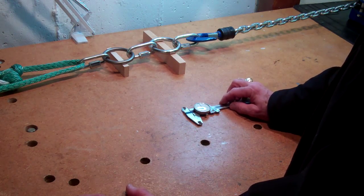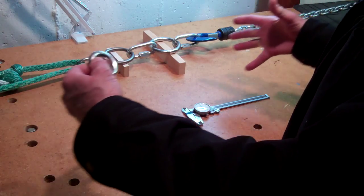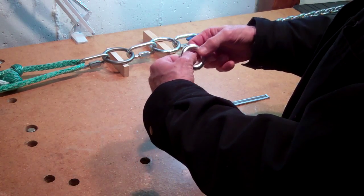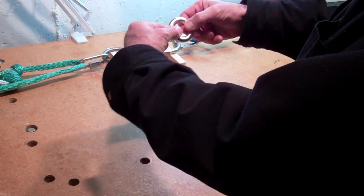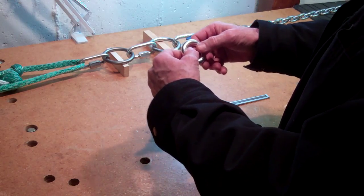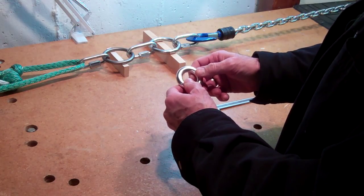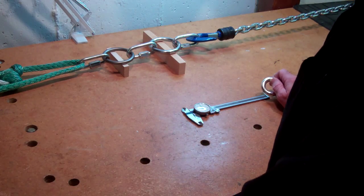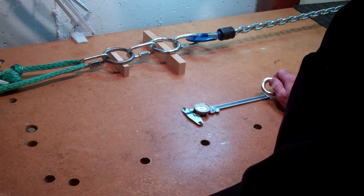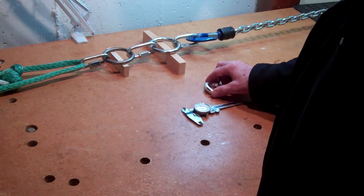Normally what you would do is take a ring, put it in a nice hydraulic rig with calibrated load cells and computers, pull it, measure the stress and the strain, eventually get to the yield point and the maximum breaking strength, and have all that information. I don't have any of that equipment, but I still want the answer.